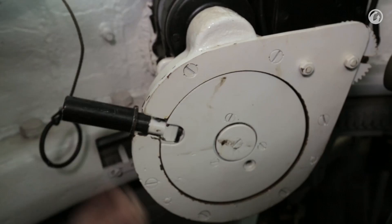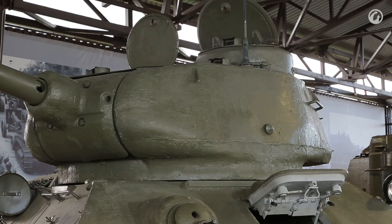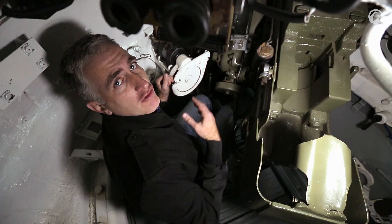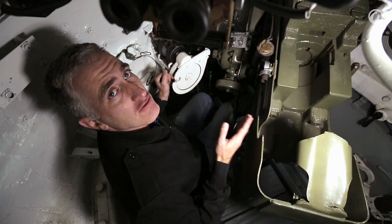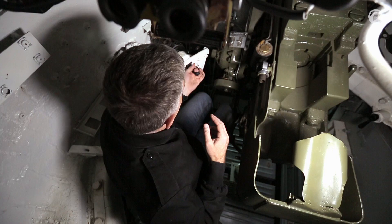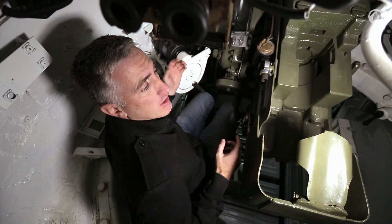If I try spinning to the right — power! Going back, note how there is momentum in the turret — how it continues to spin even after I return to the zero position. So this is purely a case of traversing quickly to get roughly on target, then going back to manual mode for the final lay to service the target. And you saw how fast this thing spins — it would be tough being a loader holding that big 85mm round as the turret is spinning around unpredictably, because you don't control it.